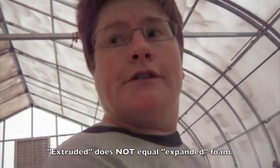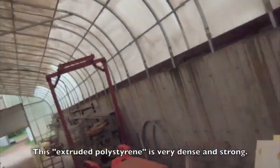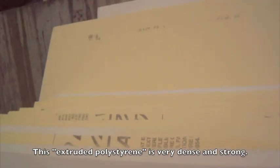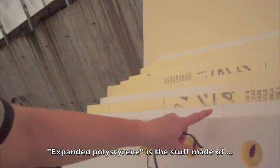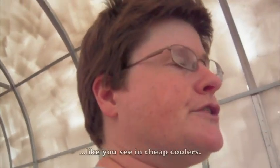But if you paint it first, then try to drill the holes, you get all sorts of weird paint flakes coming off the edge, and in some cases I've actually seen it peel off, and you get weird things on the edge. And so I'm painting at the end. That will save me paint. However, it's going to take me years in order to get it done.